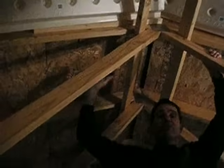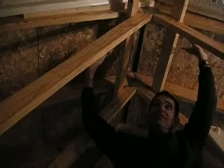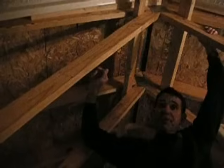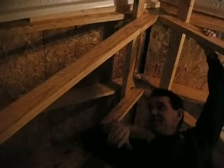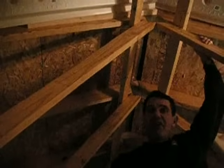With our baffling in place, we can insulate nice and tight. The airflow from the soffits will flow up and out the ridge, and it'll be a beautifully well-ventilated roof. It'll be well-insulated underneath, and I won't have any trouble with my shingles because my roof won't get too hot. All this has been achieved with about an extra four or five hours of work to get all these baffles installed.